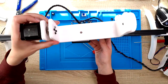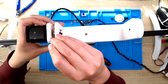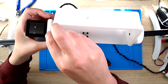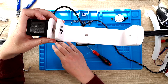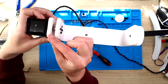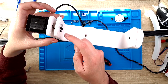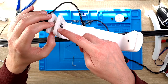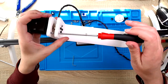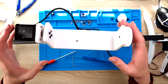Just like this — it was pretty tight. Now we tighten these grub screws onto the stepper shaft. That's the final step — we have to put in the screws to hold the stepper. This is a little bit tricky but there are holes through here, so carefully you tighten them. And then we are done with the mechanics.